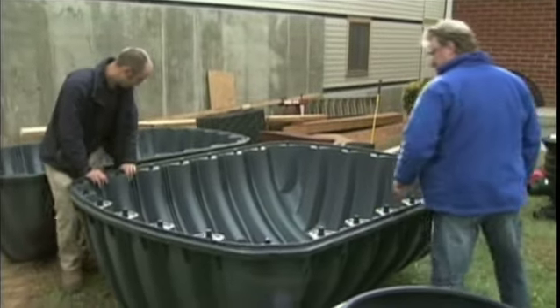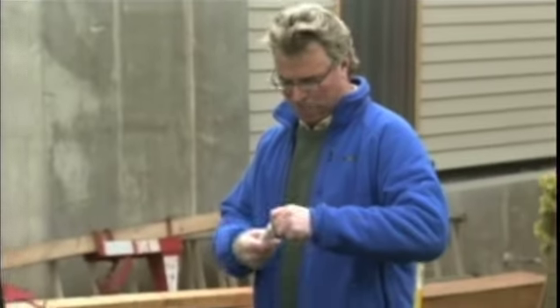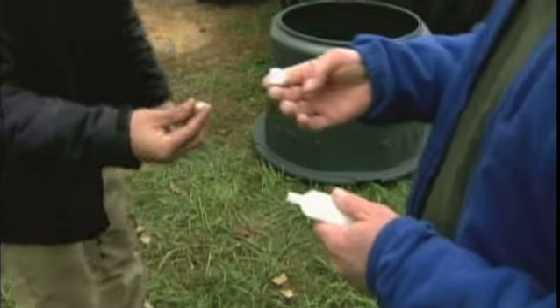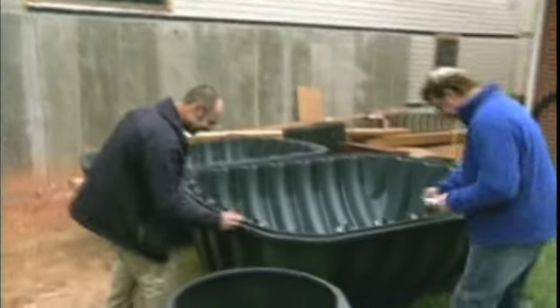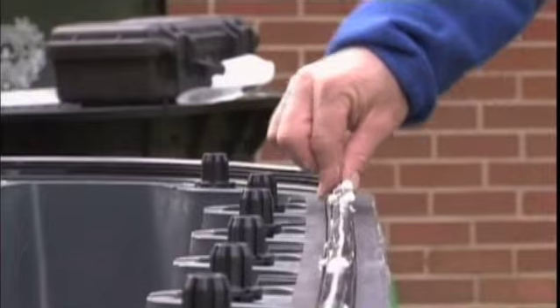The gasket makes the tank watertight. We've got the pegs in, we've got the gasket in. Now we're going to lube this. What is this stuff? This is just a water-based acrylic lubricant. Squirt a little bit in your hands and just lube it up. The purpose of the lubrication is just to make an easy fit so that when we drop the top it seats properly.